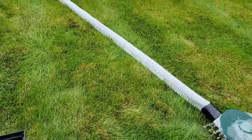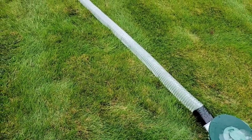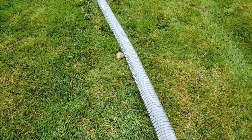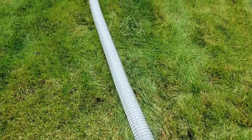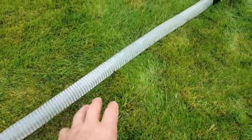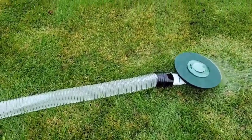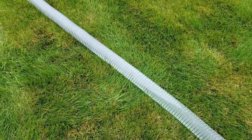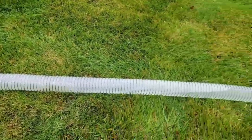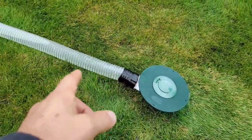Now we're going to stop feeding this pop-up water. We'll shut off the hose that's feeding this corrugated pipe and see how much water is left sitting in the pipe. The water all runs down to the pop-up. There's less pressure, less PSI, but it's still running out at one percent slope. Let's see how much water we're left with.